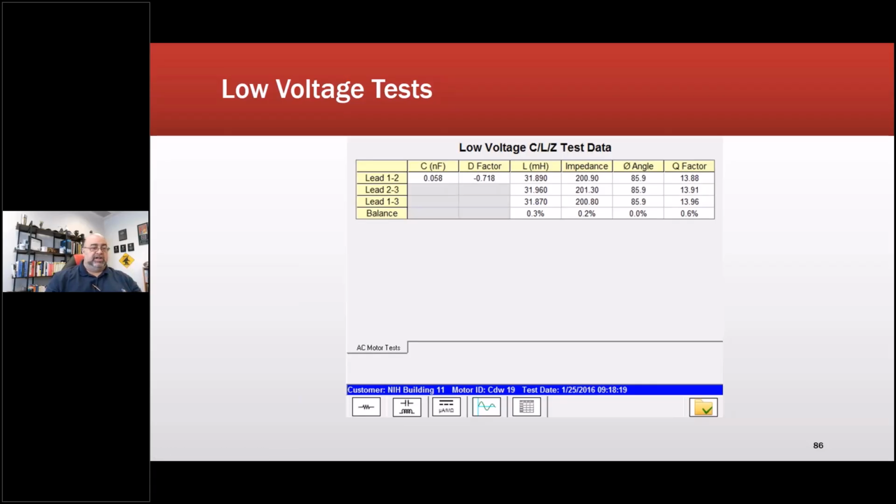So if I have a machine that's running but does have a defect, and I do a high voltage test and trip that defect, I have now made it so I can't run it. So I'll use the low voltage tests ahead of time. In cases, I carry an All-Test 7 now. So I will use that, and then I'll switch over to this after I've made sure that everything's good, before I hit it with a surge test, depending on what confidence level I want.